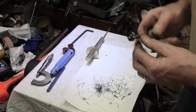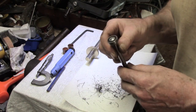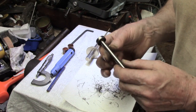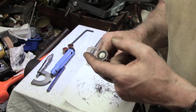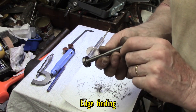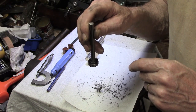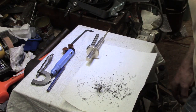The other thing - another copy - somebody suggested I go look at Double Boost's channel, which I did. And that last double bearing centering thing I made - he obviously had made one himself and used it a lot. That's the other thing he made. So I got a piece of three eighths drill rod and a bearing that I happen to have, and I'm going to try that out for centering on the mill. Put some black dots on there so I can see rotation. We'll put that in the chuck or collet preferably, take that up to an edge, see how it works out.